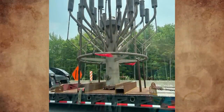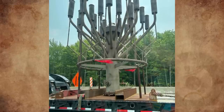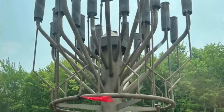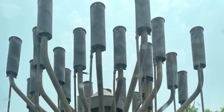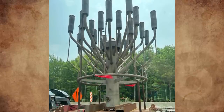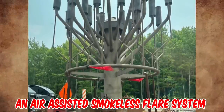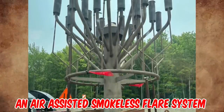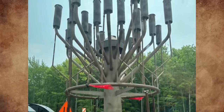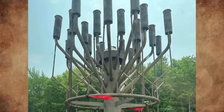What is this large metal exhaust system with multiple arms from one large pipe, seen in Baltimore, Maryland? It looks quite old with multiple arms coming off one central pipe that has a ring around it. The tips of the arms have partial lids like the top of a chimney. It looks like an air-assisted smokeless flare system used in the oil, gas, and chemical industries. It uses blowers to inject assist air directly into the waste gas stream as it exits the tip, resulting in smokeless burning and long flare tip life.